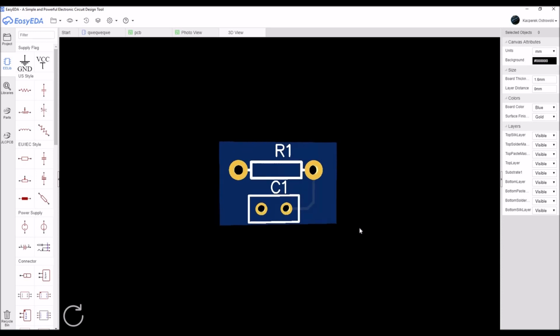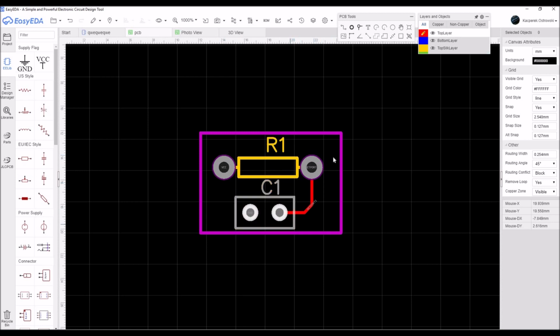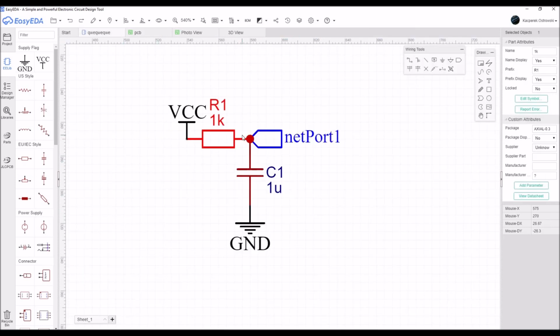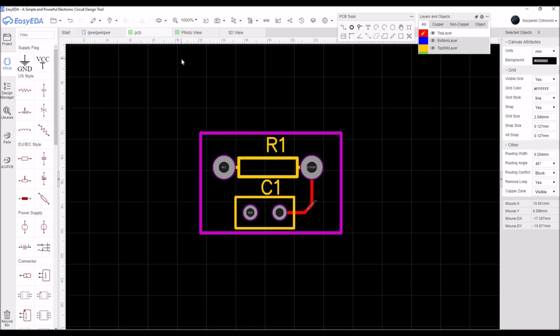Of course, sometimes when you have a not very good part that was contributed by some user and he didn't do it very well, you won't have the PCB mount position of the part. There are some parts that are only for schematic view and not for the PCB view, so you need to keep in mind that some users don't contribute the spacing of the leads and pins and all this stuff in their parts. And that's really it.